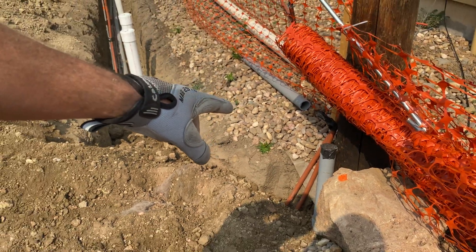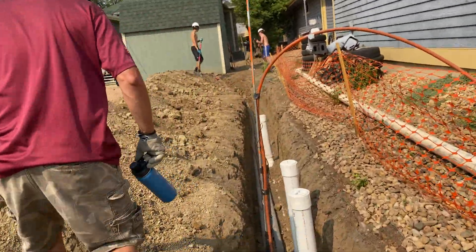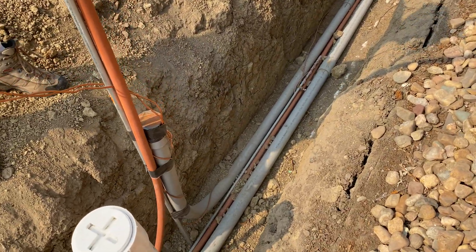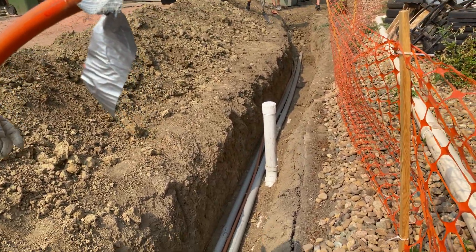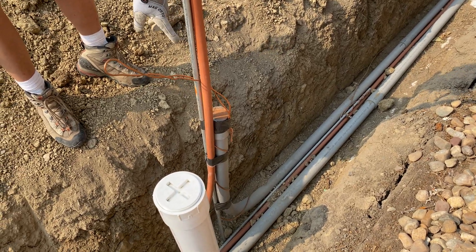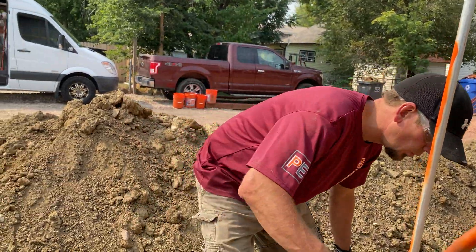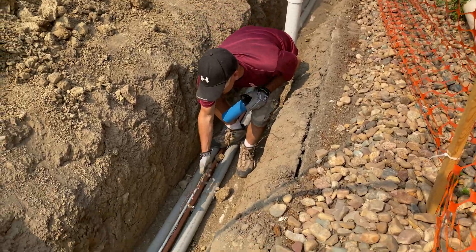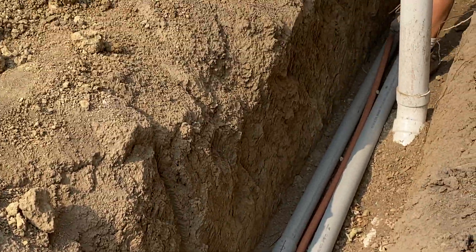And then I did the two coax lines — I think Comcast. But as you can see, there's another conduit back up here. So my two-and-a-half-inch is my primary to my building — well, let's just say secondary power. My service feeders are going in, and then my sub feeders coming out to the building is in a two-inch schedule 40. In the ground I have my two ground rods — one and two.